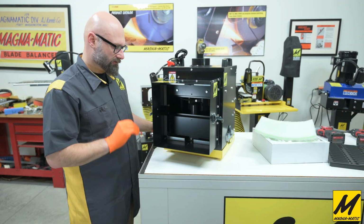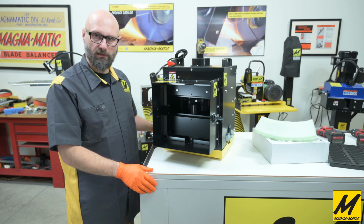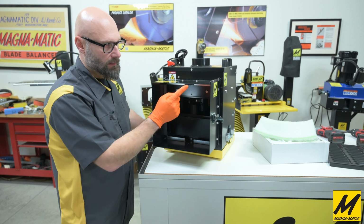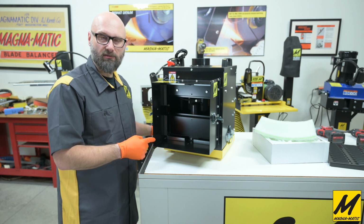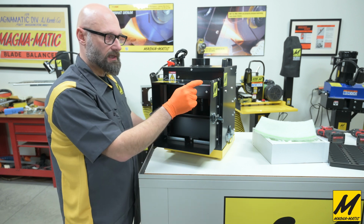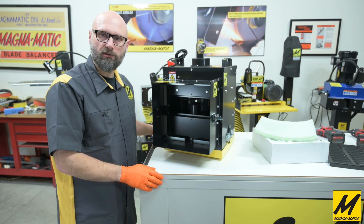Now that we have all the caulking finished, all the 2 outside screw holes filled again and caulked, we are ready to load the filters in. But one note to make: when you put caulk in these 2 corners, please wait at least a good 15 minutes or even an hour for that caulk to dry, or make sure you really wipe any excess out of these 2 corners, otherwise it'll get stuck to the filter.